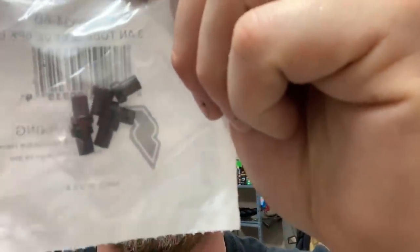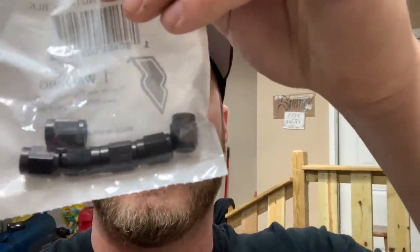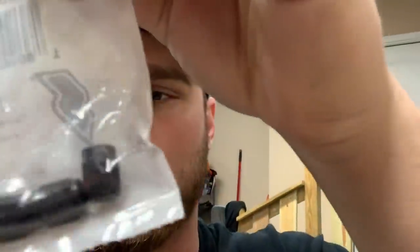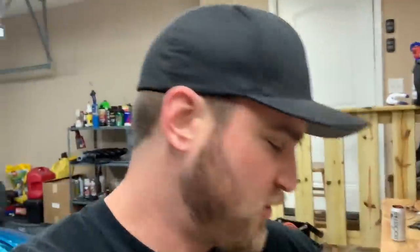How do we make AN lines — or AN female ends, rather? You need a couple of things. First, you need tube sleeves. These are 3 AN tube sleeves from Summit; they come in packs of six. The other thing you need is tube nuts — it looks just like an AN female end, because that's what it is. Tube nuts, tube sleeves, flaring tool, tube cutter — that's what you need.